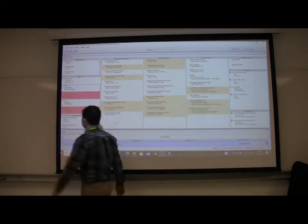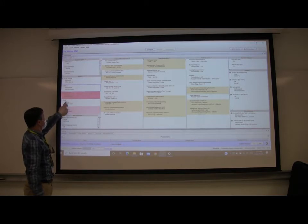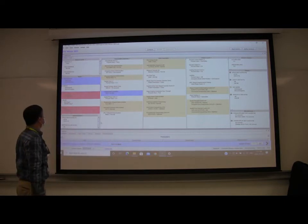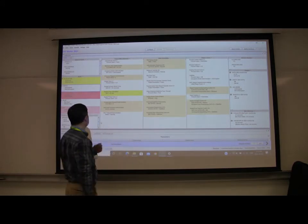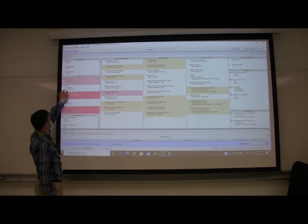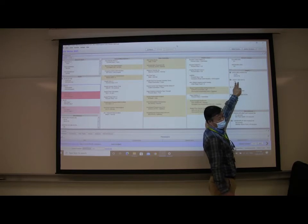Now we simulate, we commission, we simulate to change the zone temperature and the set point. You can see what happened to the system. So from here, commissioning interface, you can see the system operation. Now the occupancy sensor is covered, so it's unoccupied. The occupancy mode is unoccupied. The lighting is off.